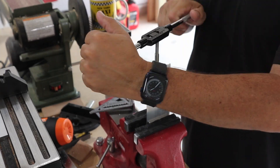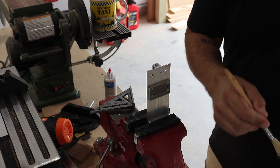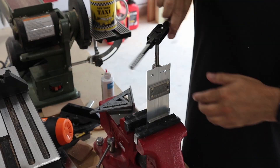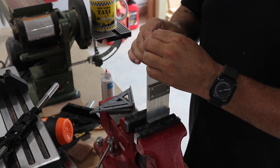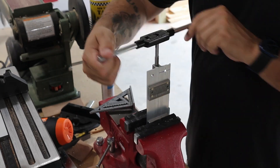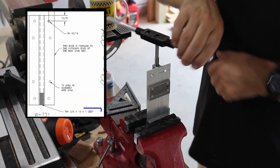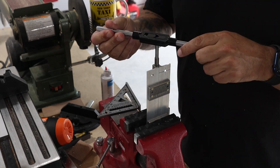This is a good angle — you can see the spacers with the flush rivets that hold the nut plates to the opposite side of that assembly, and then the holes for the bolts that will bolt on the aileron bell crank bracket. That's the bottom side that nests up against the forward side of the spar. The instructions say to tap to about an inch deep — which is basically the length of the cutting portion of the tap I'm using — 3/8-16, one inch deep.